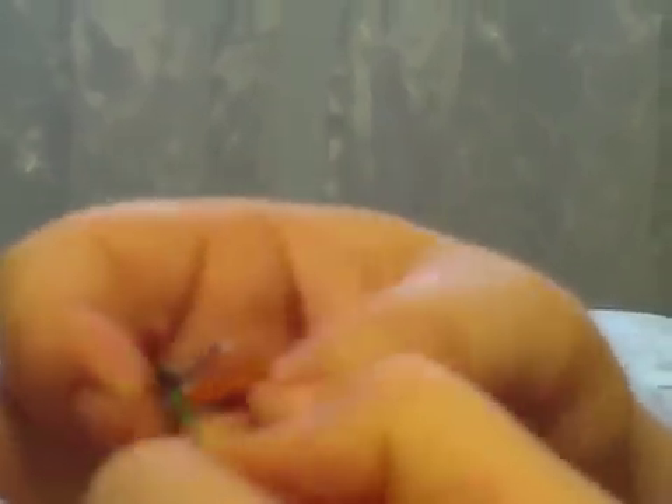So those are the ones that we need to cross over. So again, in this example, for the crossover, we're going to do green-white and green instead of orange-white and orange. So we'll move these over here — move our green-white and green where our orange-white and orange was — so our receive has become transmit.